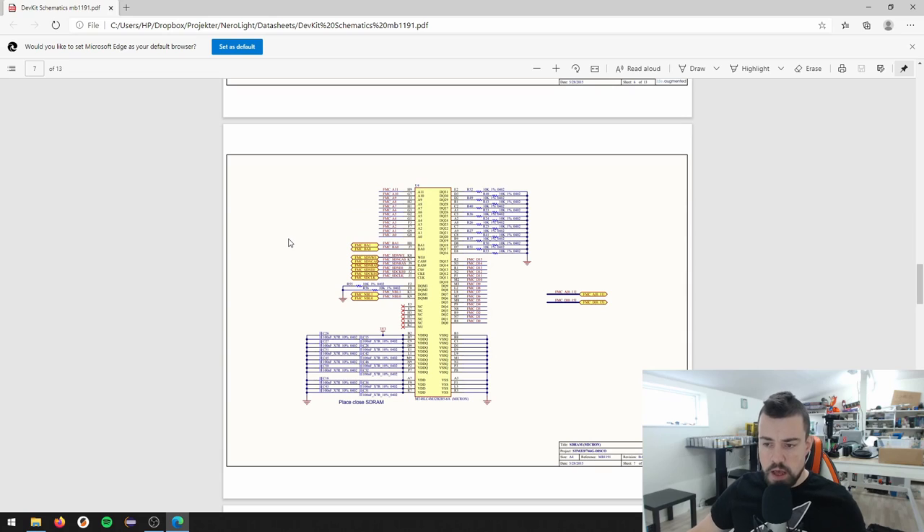There is an SDRAM. Why would you put SDRAM on a board like this? Because this video is all about running TouchGFX on an embedded system. TouchGFX only requires one framebuffer and you can store that internally. But TouchGFX allows for a third framebuffer - previously called animation storage. If you want fancy transitions where screens slide on top of each other, you would want multiple framebuffers and external RAM. If you're not going to use fancy animations, you can actually skip this.